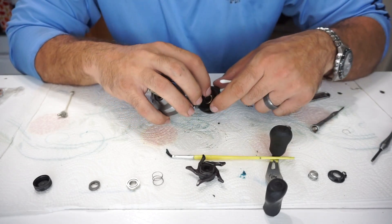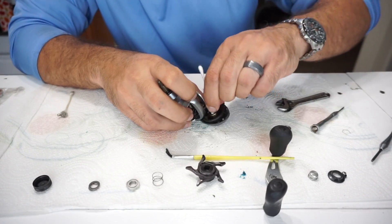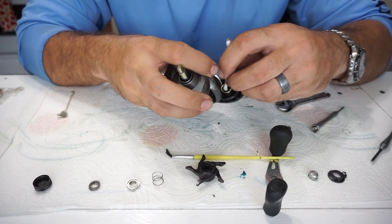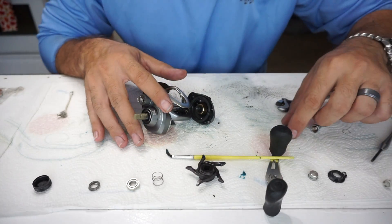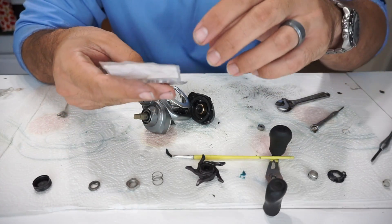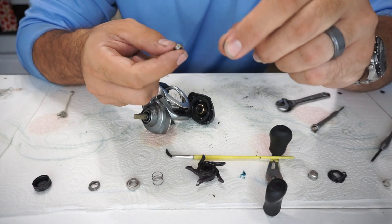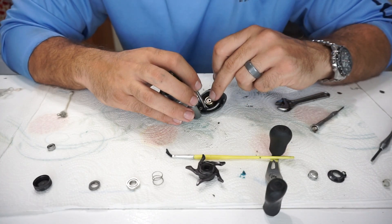There's a small keeper that holds the bearing in place - pop it out carefully, these are really small and easy to lose, so keep your finger over it while removing. There's the little keeper and there's the bearing. I take a clean cotton swab and clean inside the housing and around the brass race. Then I match up the bearing with the right one from the package - the OD and ID match, so I drop it right in, and it pops in. Then put the little keeper pin on top to lock it in place.